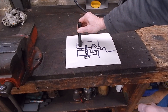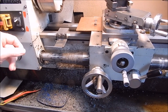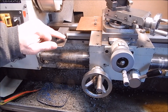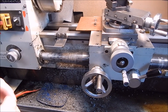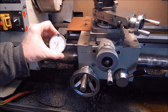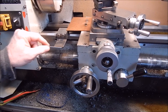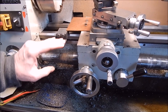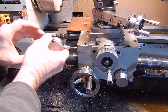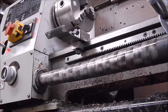Here is another bolt going through parallel to the carriage ways, and that is an adjustable stop. I've also got a bracket coming out from the side of this unit, bolted on with a couple of little bolts. That's so I can put a dial indicator on there and do very fine position adjustments against it. It's just a simple addition — a bit of bent metal and a couple of holes. Very useful particularly if you're milling on the lathe, because you need those fine adjustments — your hand wheel graduations are okay, but for really fine work the dial indicator is the way to go.